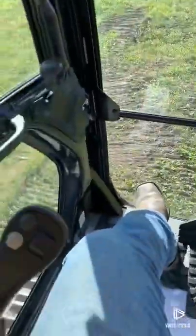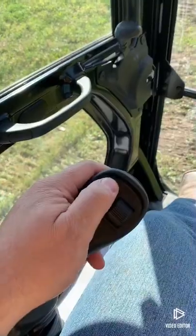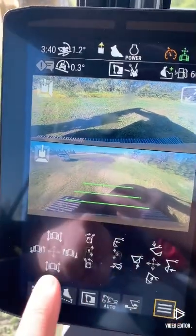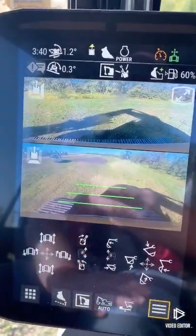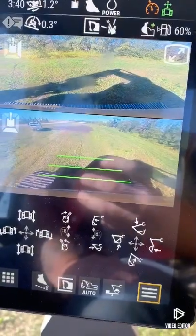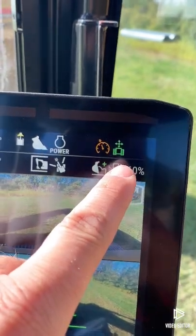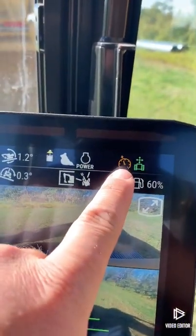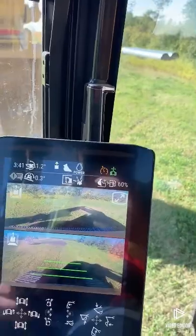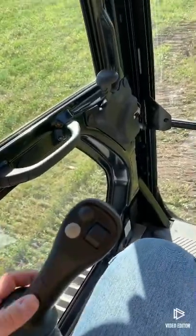On the left-hand joystick, from the factory there's a little black button. When we press that, you can see on the screen we get 'joystick steering active.' There's a nice indicator showing that the controls have changed and where your hydraulic functions have moved, so you can still run your hydraulics while tracking. Up in the top corner there's a green indicator showing we're in stick steer mode, plus a speedometer indicator lit up in orange — that's the cruise control feature. Now we press the left-hand joystick ahead.